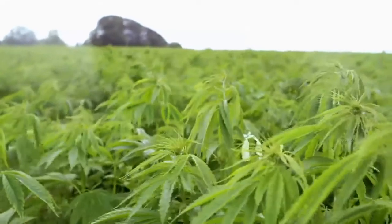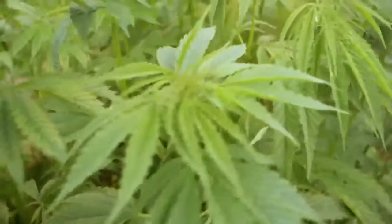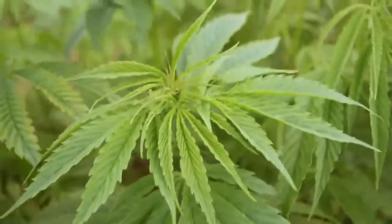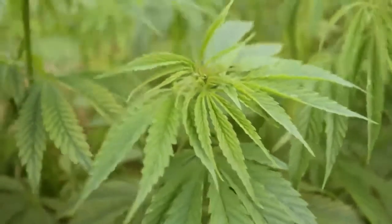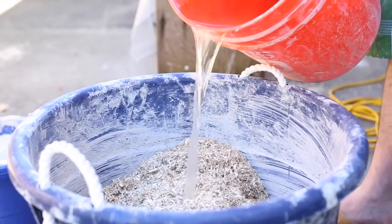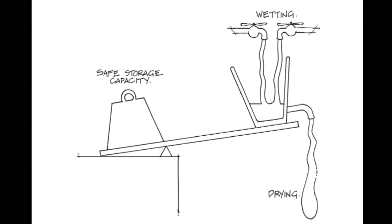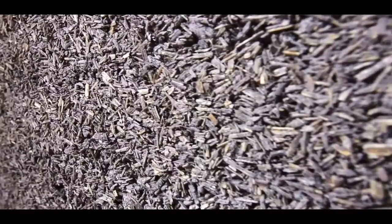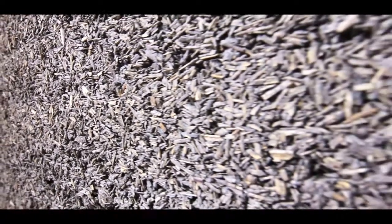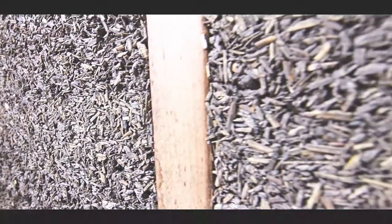Like other plant-based materials, hempcrete is able to absorb a great deal of moisture with its natural porous structure. The moisture is absorbed into the internal surface area of the plant fibres and then absorbed into the cellular structure of the plant. It is a very useful characteristic in a building material as it allows moisture to be taken in by the material and stored until conditions change and it is able to be released.